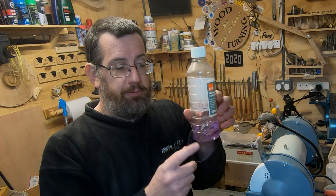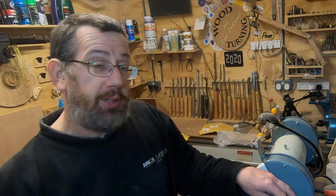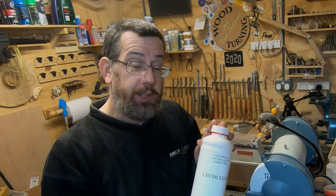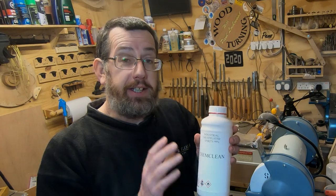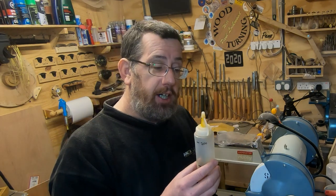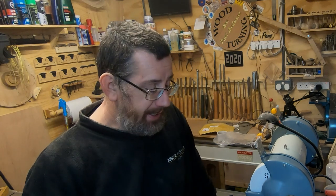For us in the UK, the alcohol is methylated spirits — elsewhere it's probably called denatured alcohol. In the UK, methylated spirits from the shop comes in this purple color, basically a dye acting as a warning. You can also buy clear — I got this industrial methylated spirits off eBay and it's totally clear. For the blonde shellac I prefer to use the clear, as you're not introducing that extra color into the shellac.